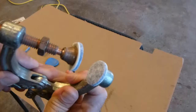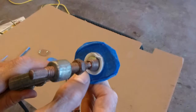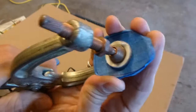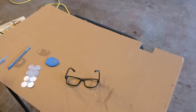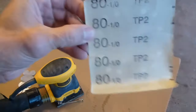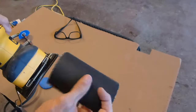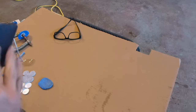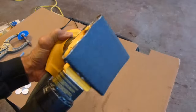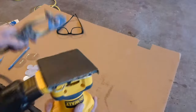This is a clamp used for sheet metal. I've put furniture pads on it for added protection. I'm only going to use this clamp while doing the heavy grinding — while I'm trying to get really close to the pattern line. Once I've done that, I prefer to hold the lens by hand while shaping it. Lenses have a 45-degree cut, and we'll get to that in a bit. We're using 80-grit for this process. I found it's a good medium because it goes through the lens fairly quickly but still gives you some shaping ability. Let's get to work.